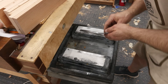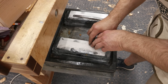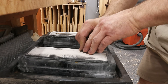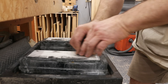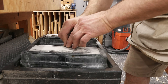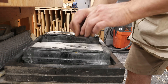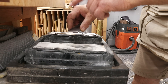Now we'll do the bevel — this is really quick. Primary bevel is 25 degrees. Set that down on the stone until you can find it. A big advantage of a thick blade is you get a large primary bevel, easy to locate. Keep your hands tied together, find the primary, then raise up just a few degrees. Little tight circles — the smaller the circles, the more accurate and easier to do freehand. About 10 seconds of work on this stone. At the end of 10 seconds you should be able to detect a slight burr that runs corner to corner. If you get it, you're done with this stone.